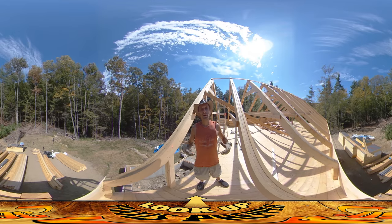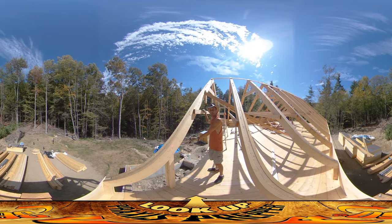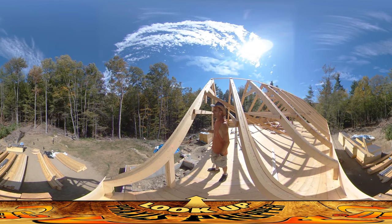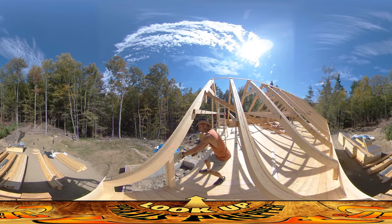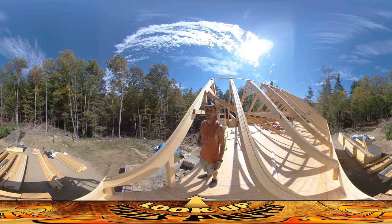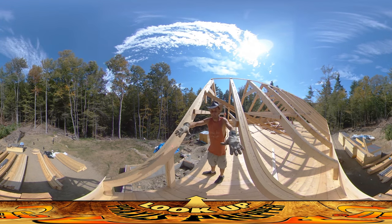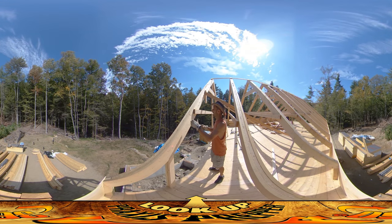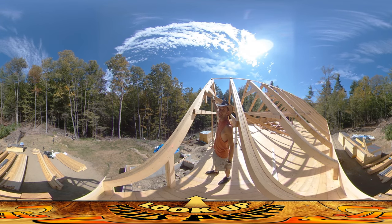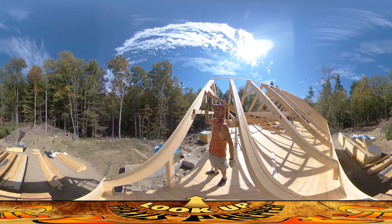But there's a problem with that, which I realized yesterday late in the day: this wall here — it's not just going to be left a giant open pit on the side of the house. We're going to be putting wall boards on here as well, and I was thinking about the procedure. We're going to be nailing them up to the posts as we go, but for the last nailing the easiest way is to come over the top and do the nailing of the end of the board as we go up. If I put the roof sheathing on here, I'm going to have to lean out through there or do it from a ladder — and certainly once I get up to the top and can't stick my body out there anymore, I'm going to be up like three stories in the air on a ladder.